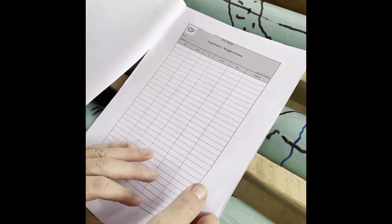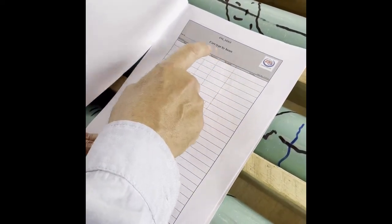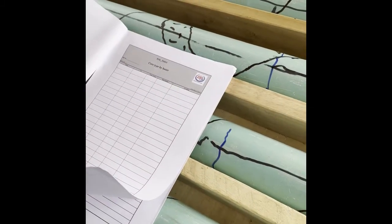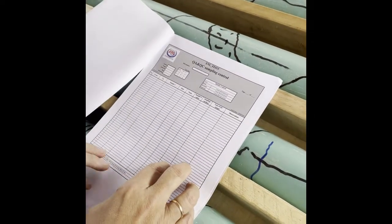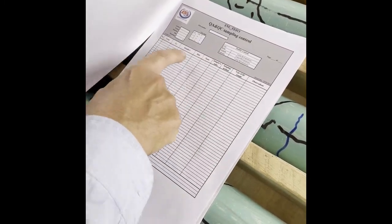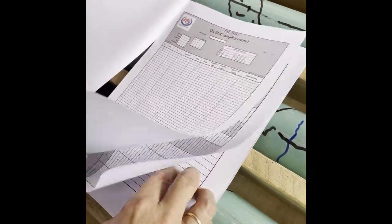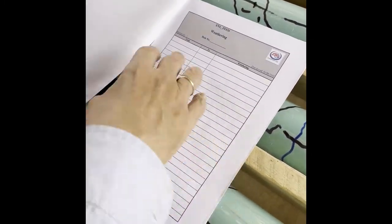This is the weight of the boxes — I explained why it's so important to have the weight of the core by box type. We are going to be drilling two sizes: HQ and NQ. HQ is thicker for the beginning, then it goes to NQ which is faster. Then the sample control — this is Tulu's sheet — all your samples: this is a duplicate, this is a regular sample, you write it down here. And then the RQD, which I already mentioned.